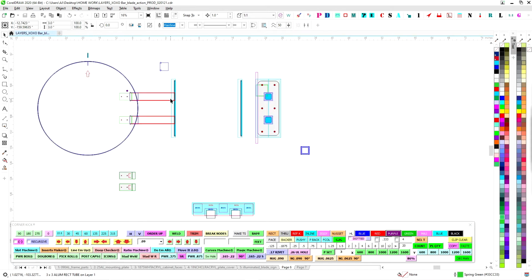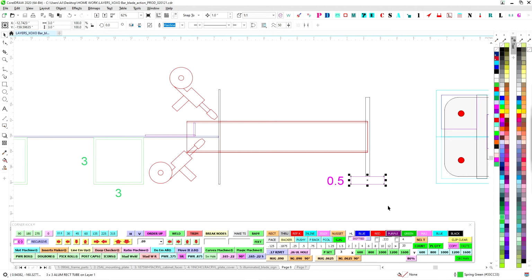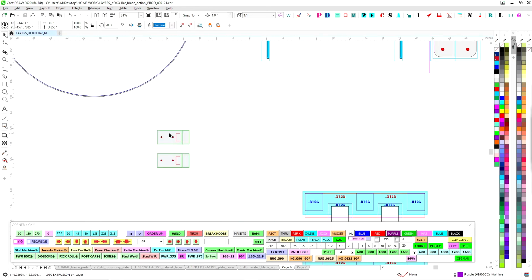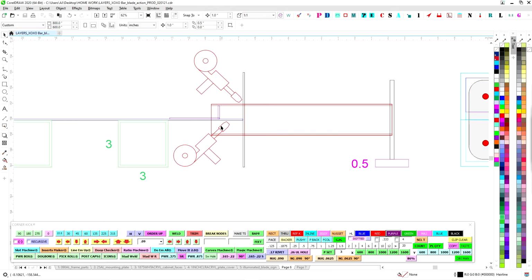I would suggest tacking these very well, but just tacking these, don't heat these up yet. Just tack them to the plate. That way it gives you more ability to slide in without this being kicked in and all this overheated, and then it's hard to get these in. So I would just tack these to the plate, and then I went ahead and made the plate to where all you need is a 1/2 inch flat bar. So grab one from underneath your table, and then you'll go ahead and cleco in temporarily like you did before, these little guys. And these guys here help you get this centered up nice, so that way on your table everything's all in one line.